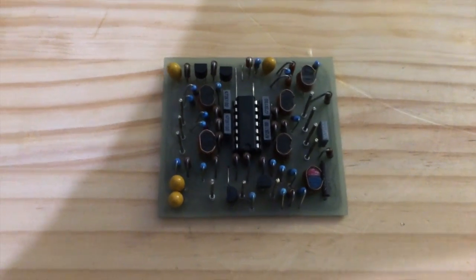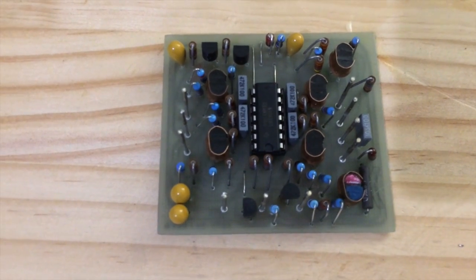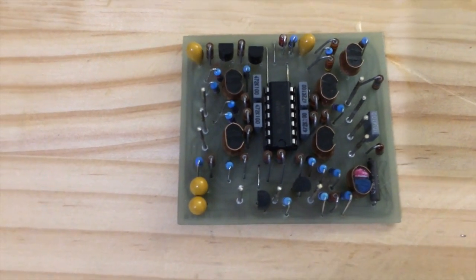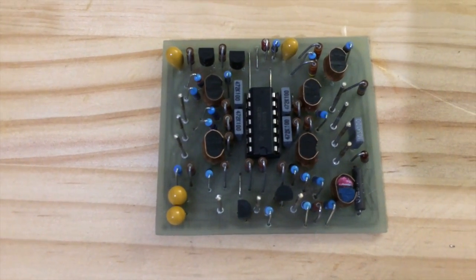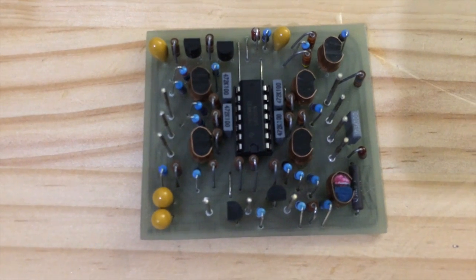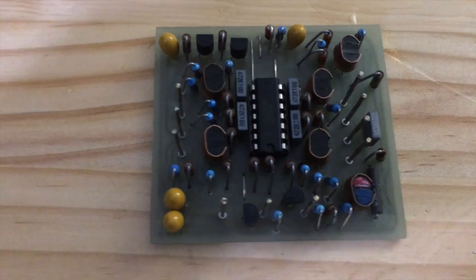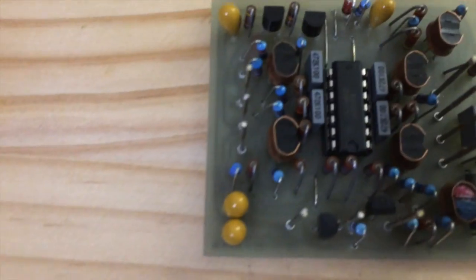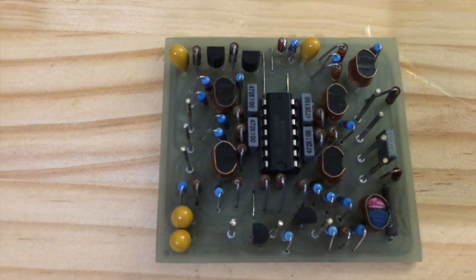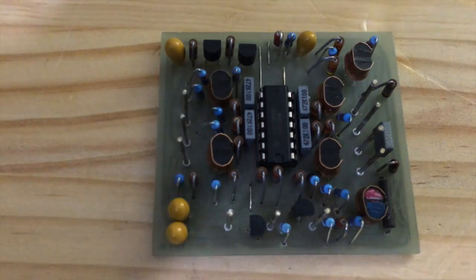Skipping ahead a little — I've replaced a lot of the resistors. The tolerance on the originals was quite bad, at least 20% out; some 220 ohm resistors were measuring nearly 260 ohms. With that much variation I thought it was no harm putting in 1% resistors, so I did as many as I could. I left the 22 megaohm ones in because I didn't have any. I've also added a 6.8 volt Zener diode at the top here, which corrects a fault in the conditioning supply for the negative rail — this is documented in the service notes.